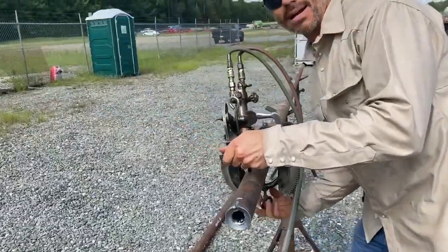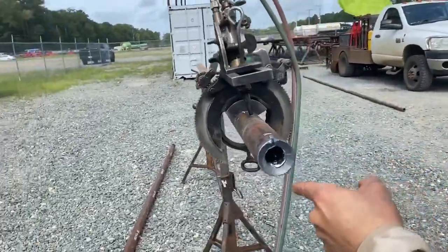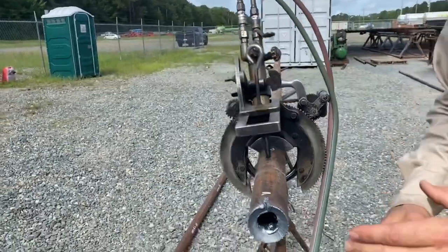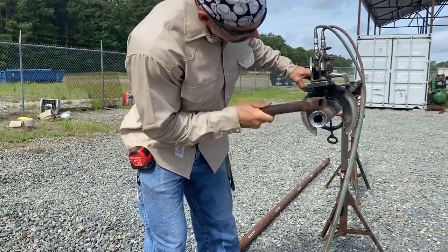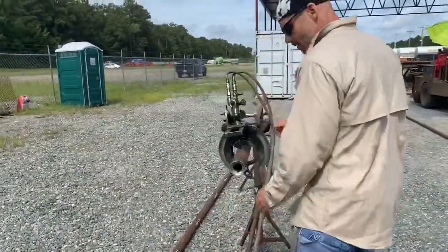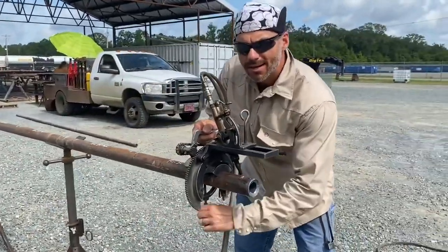Put your machine on here and lock it down. Now, when you get started cutting on a piece of pipe, a lot of times there's slag in there. When that torch comes around and hits that cold slag, it's gonna blow out and mess your bevel all up. We don't want that — we want a bevel that looks sharp and perfect, it just makes it easier to weld. So we gotta get that slag out of there. Just smack it a couple times — boom, done. Don't waste any more time. You're only worth what the market will pay you, so you've got to bring value.